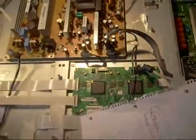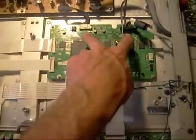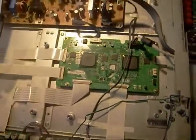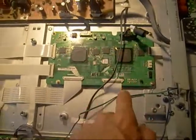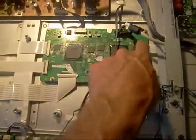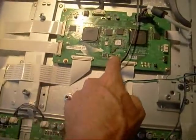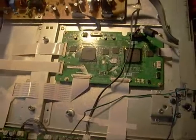What was interesting is when this TV came in, these two LEDs were flashing on this logic board here — one right here and one right here. When it was first turned on, there was an additional LED that came on at the bottom, just momentarily, and then it shut off. The TV was completely dead — no screen lighting up whatsoever.